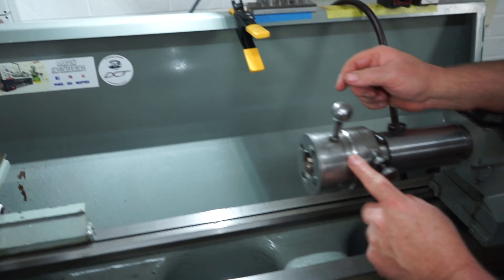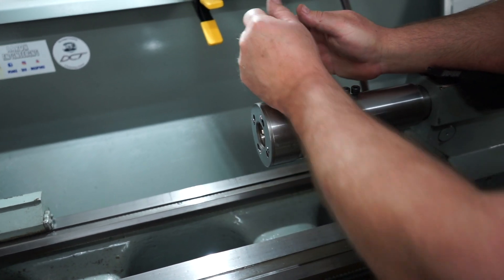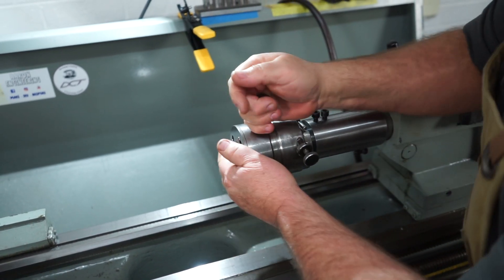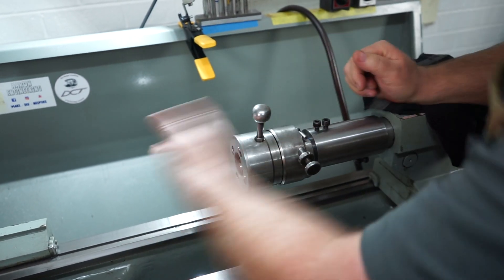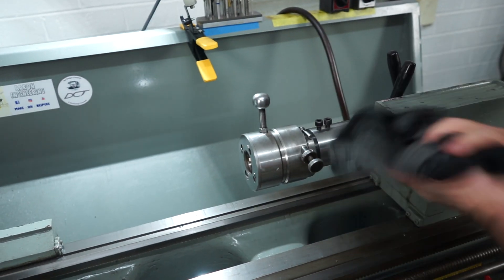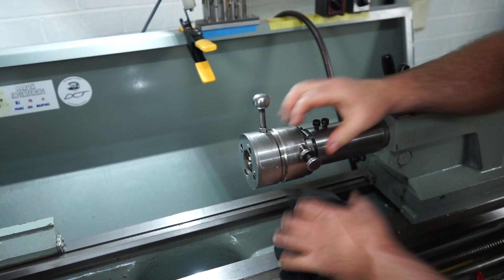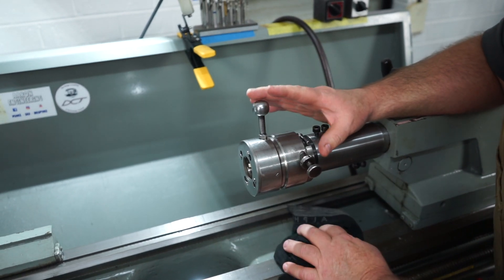So here's the Coventry die setup and before I could use this today it was actually seized. So I had to pull it all apart and oil it and that took a good couple of hours. There's quite a bit of tension to pop it out of gear there as you can see. And you've got to bang it to get it back in. All right and then ready to thread. I've left the lever here — you can actually have an oversized and undersized cut. I've just set it up on the maximum opening, adjusted and locked it, and I'm getting a good success rate with it.